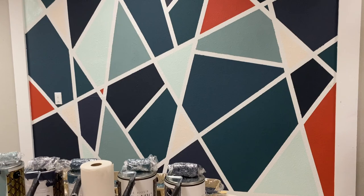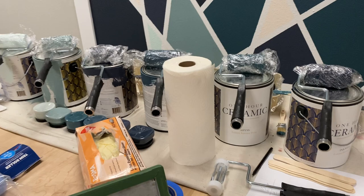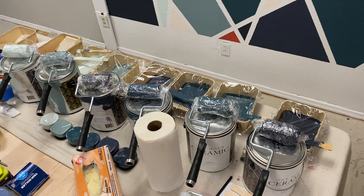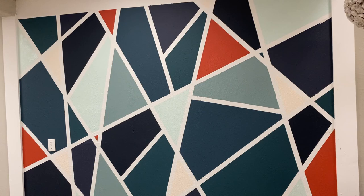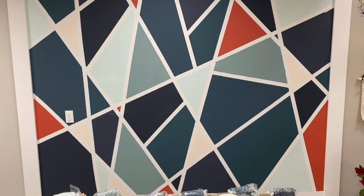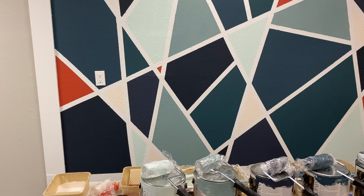After all the tape is gone, this is what you get — beautiful white lines from pulling the tape off revealing the Snow Owl base. Here's a look at my table setup too: get rollers and roller covers for each color rather than swapping out one roller — it makes things go by much quicker. This is the final result — One Hour Ceramic matte finish, beautiful color saturation, durable and scrubbable. Hopefully this video was helpful and shows just how easy it can be to make your own accent wall at home. If you enjoyed it, hit like and subscribe, links to products are in the description — have a blessed day and happy painting!